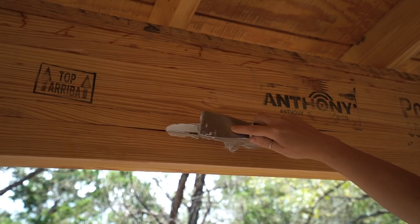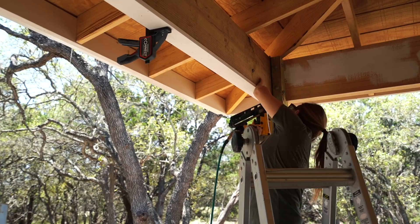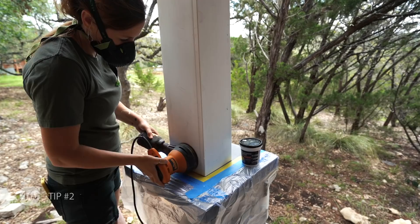Don't only look for low spots in wood but also any joint, such as on my post which is made up of four boards. Or if you have a monster defect like I did on the bottom side of a beam, instead of filling it in, cover it up. I nailed up a one-by-four on the bottom side, puttied the joint, and now with paint you can't even tell I had a problem or did a cover-up job. After letting putty dry, you just sand it a bit to knock it down flush with the surface.